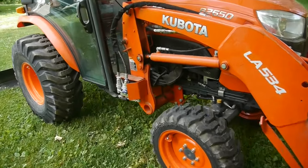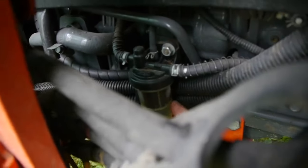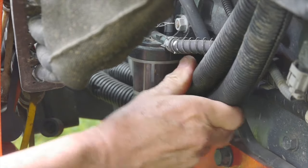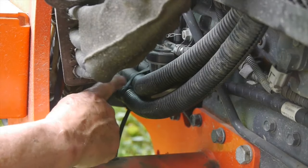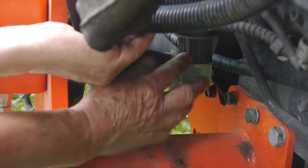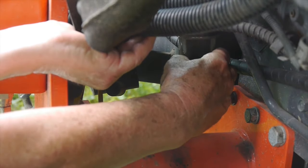This one has a little O-ring. There aren't any fuel shutoff valves on this tractor, so we're just going to spin that cartridge off. I discovered there were wires right there zip-tied together, and they were pressing up so hard against that case that I couldn't spin it off. So I decided to take that zip tie off so I can lift those wires up out of the way and now we can get to this thing and it'll spin off freely.